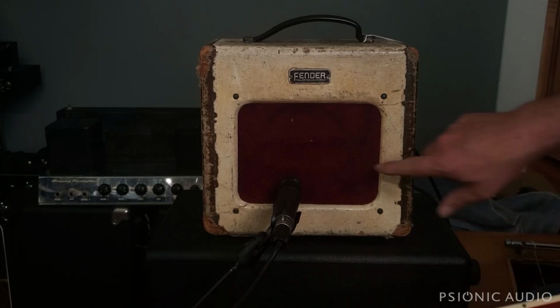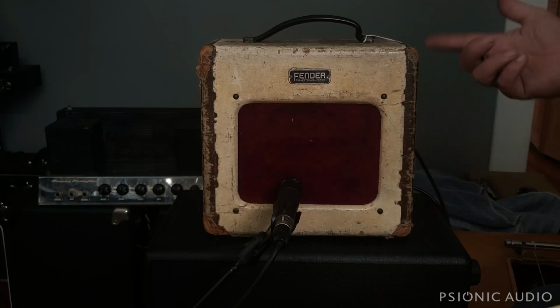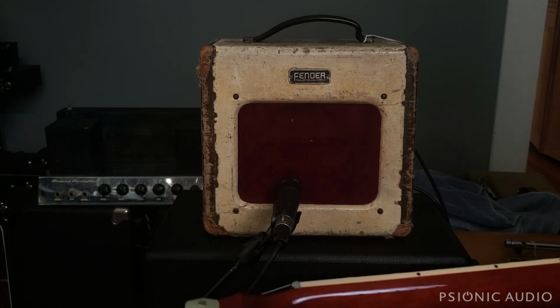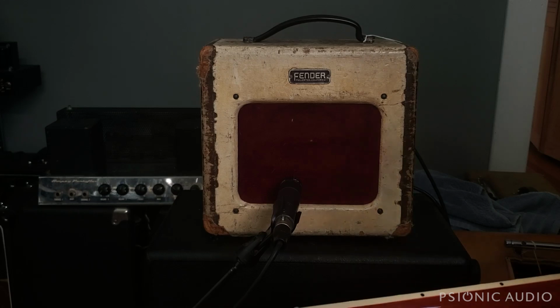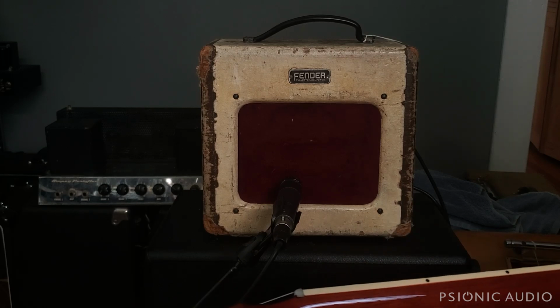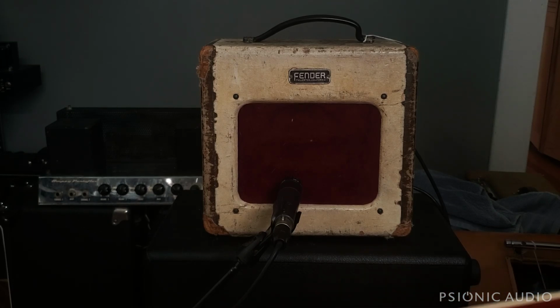So once the noise from the hole in the old speaker went away with the new speaker, and the rattle from that 6SJ7 went away, then I could hear just a background fuzziness that was coming and going. Turned out to be the old RCA 6V6. It was hard to hear because it was masked by the noises from the bad speaker and the bad preamp tube. I happen to have an old single Sylvania 6V6 that's of no use in a Princeton, etc., because it's only one of them. So it's in here. I think the owner will be very happy.